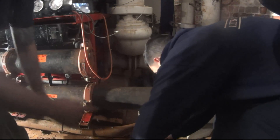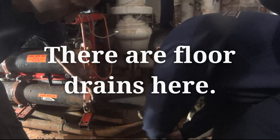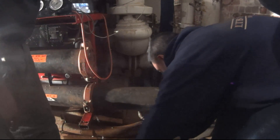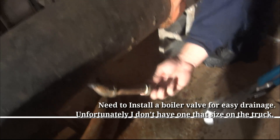Okay, we'll let that drain and get back to it. Martin's gonna open up that plug — like I said, we gotta put in a screw-on ball valve, we'll just drain this all the way. With a ball valve it would have been a lot easier. Now if you're on top of a building doing this, you want to connect a hose — get a hose, a boiler valve — put it right into the drain.